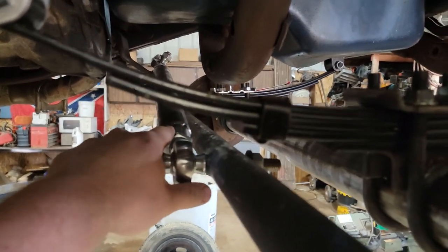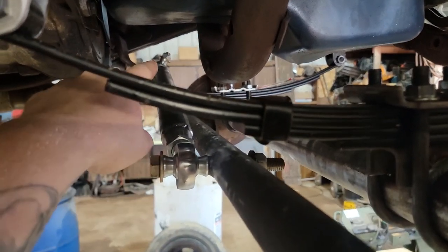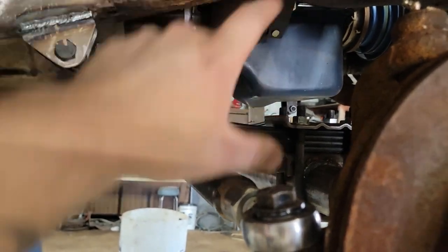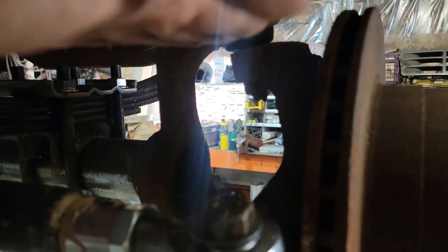What I want to do is nix this. I'm going to cut both ends back out of here and run it straight above this. I'll have to use a long bolt so that the drag link will go over the leaf spring. And then I'm going to weld a stiffener off of here - a flat plate to the top - so it'll kind of double-shear the bolt so it's not under a bunch of stress. Then I'll weld a gusset plate in there.